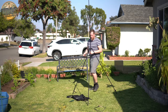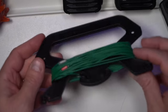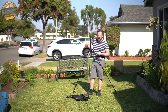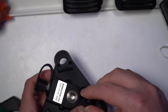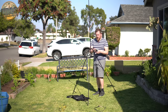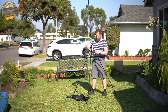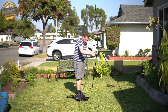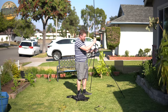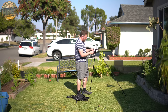The counterpoise comes on a kind of kite winder. It is a green wire that has a loop or eyelet terminal connector. It mounts under a little threaded nut right at the base of the vertical at the top of the tripod. Once it's attached, orient it in the direction you want — I want mine going east. Rotate the tripod, splay out the legs on the tripod a tad to get a good balance. Note there is going to be some wind load as you adjust your antenna, so just get it to the point where you feel it's a good mount.